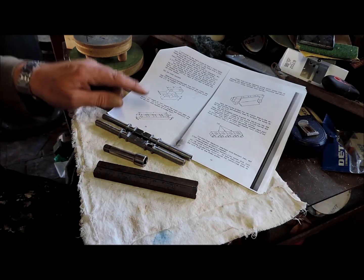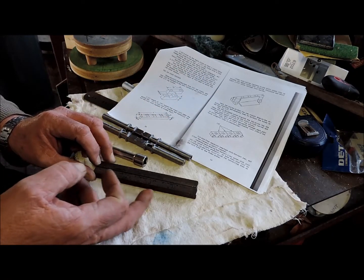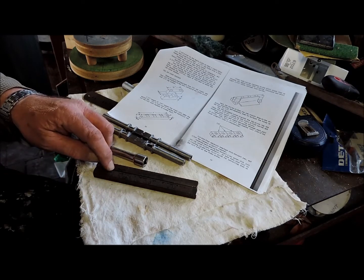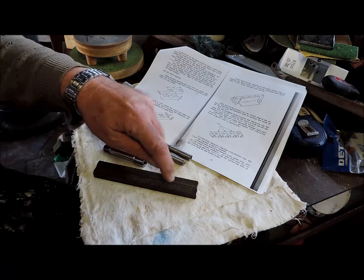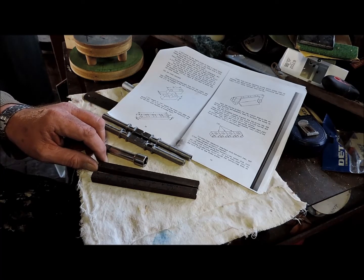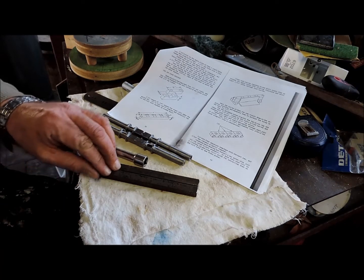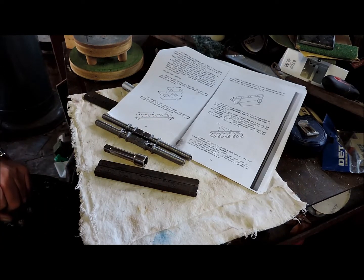You have to mark it out, clamp the two pieces together, then drill the clamping screw two positions, and the four journal positions — and that'll be two half bearing caps, or journals — bearing caps also. So that's the next thing. I'd like to clamp this and mark it up. I'll get stuck into that.